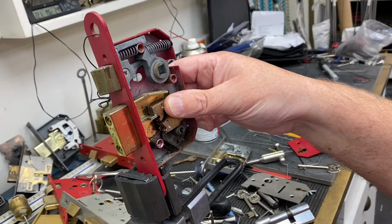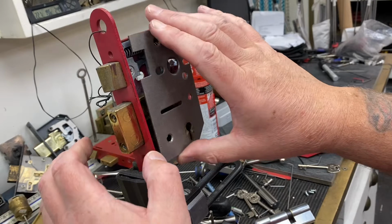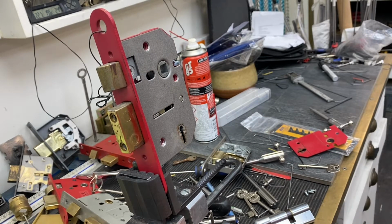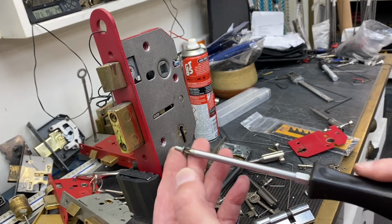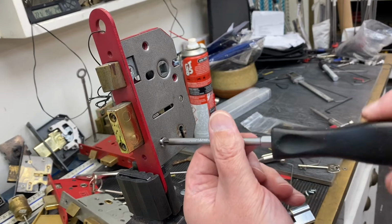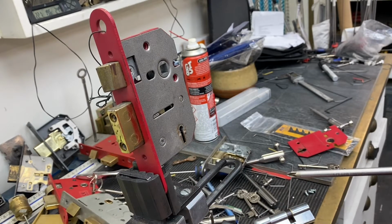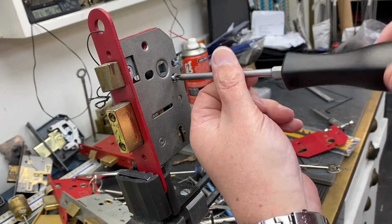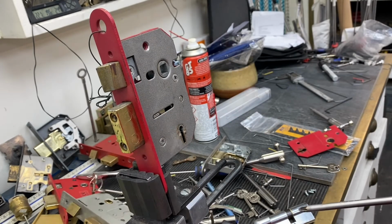We're going to use that cover. Okay, it's not completely different lock, but we're going to use the cover. It's got a little training hole in it, and that's why we can show you what's going on. So have a look at locks, what you got, and see what covers can fit each other. You'll be surprised. It's like any old lock. I never throw any old locks away. There's always some part that's going to be useful for something, because they are so interchangeable.